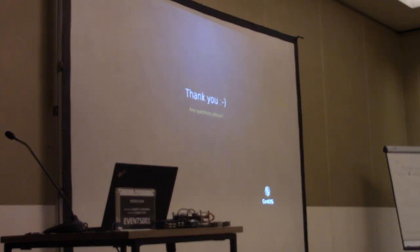Yes, depending on the layout of the factory, you may actually have different kernels at your disposal that you can boot your user up with. This is really something that is very important. And even sometimes you have video, you can see what is going on, but it just appears too late for you to modify anything that is going on at boot. Sometimes it's not even initialized, sometimes it doesn't work, sometimes the interface is screwed. I've seen it all happening. If you're out in the field, carry a serial connector with you. That's basically it.